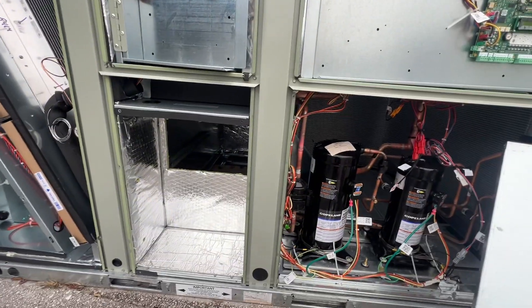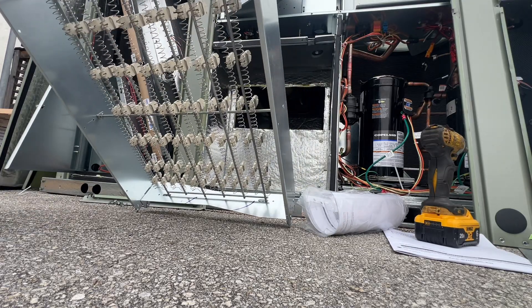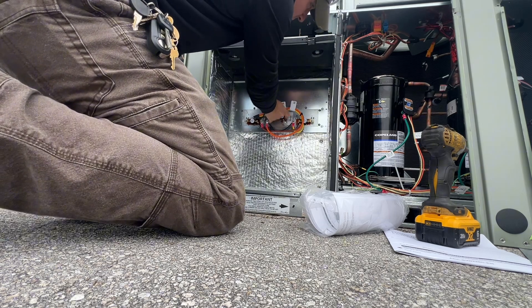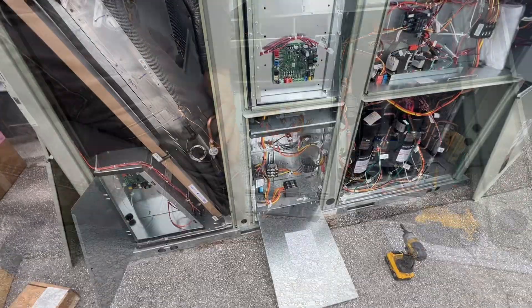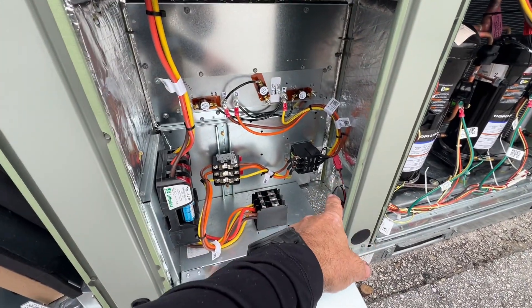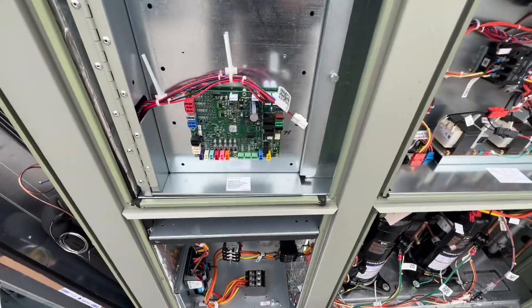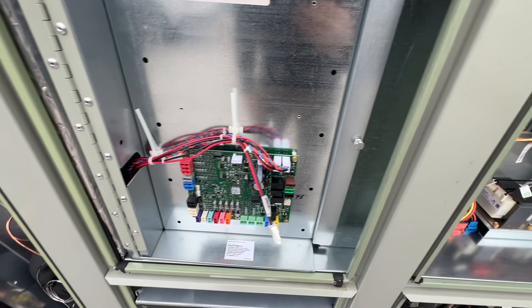Here's our heating element — it is a nine kilowatt — and there's our heater control box. We're going to take this center panel out so that we can slide that heater in there. Here's where we're at: we've got our heat kit installed, control panel installed, connected to our contactor and wired in. The option module for the heater is installed and needed to be addressed to 75.